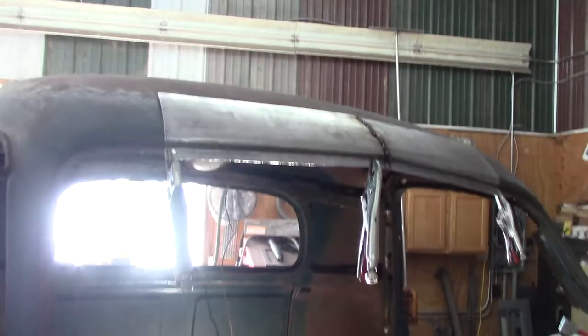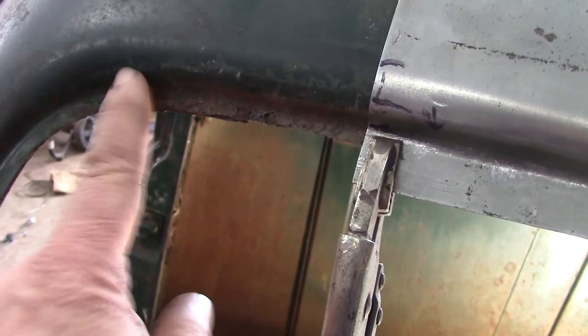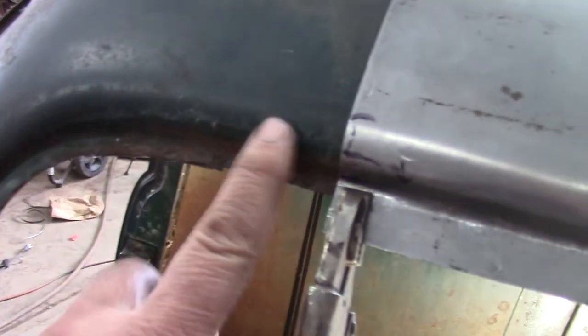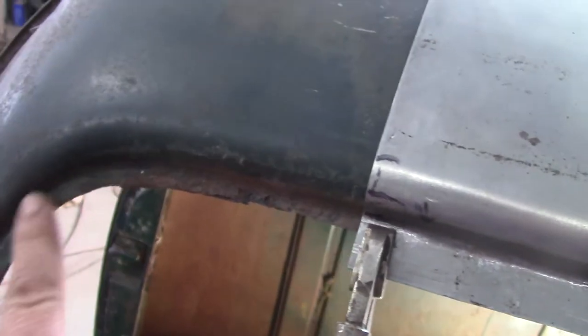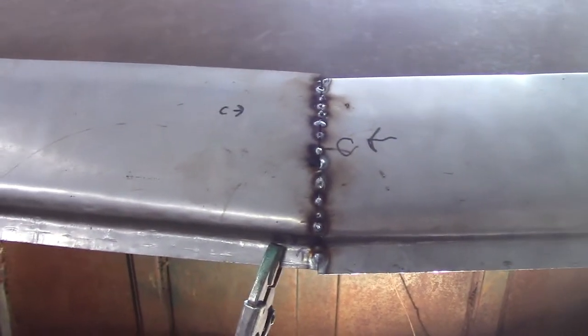The next step — I've been working on this brow piece. So I got it tacked together a little bit here. What I'm gonna do is go to about this area and then after that I get back into some more solid metal. Plus this is getting a little bit tricky because it's got a couple different contours all coming together. So what I'd like to do is avoid where it starts making that radius. I'm gonna cut a piece of steel — I got to measure it out, but it should be the same on both sides. That side looks wider for some reason.